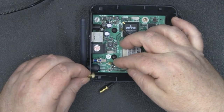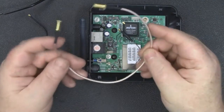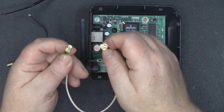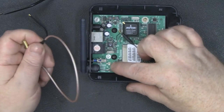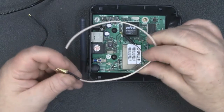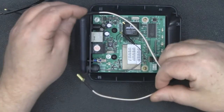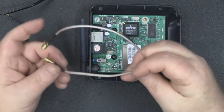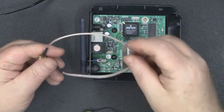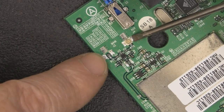What I'm actually going to do is use this pigtail with two female ends. I'm going to desolder the U.FL connector, clean up the pads, and I've got this one for 99p — I'm just going to cut it to the length I want. I'll mount one connector here and a second one there. This coax is a little bit better than the thin flimsy stuff, so it should hopefully give me a slightly better signal.